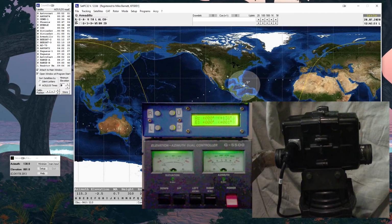And that's part of the design. It has to be able to wrap around. Well, you need to know where the end is to know where the end of the wrap is. Otherwise, you get a full rotation edge and you just unplug the rotor, you've broken the cable. So we have to start at this position. So the first step will be going full down, full left on the controller.